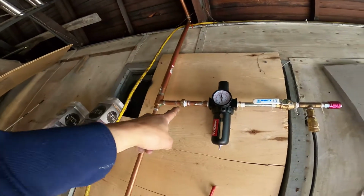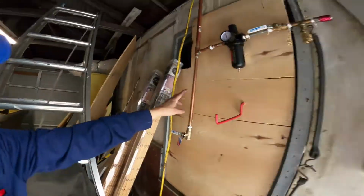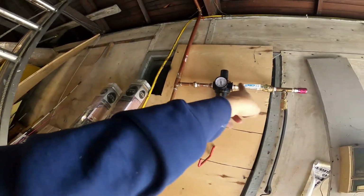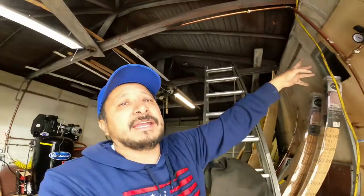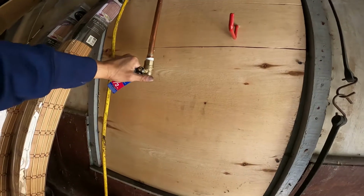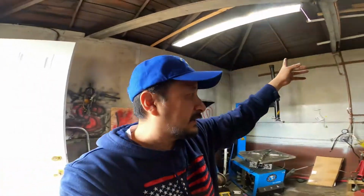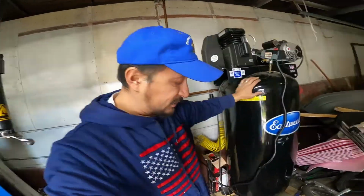If you do a small pipe, thinking you're saving money, you're gonna get pressure drop. Now the 3/4 inch drop goes into 1/2 inch. But look, I still got 80 pounds there, but I have a tee off right here. Now that's going to be my airline with the cleaner, but this right here is for any condensation that gets in the whole airline. I could purge right here. That purges any air that was in that line right there. Now why I say to have one here, because this tank is what captures the most moisture.